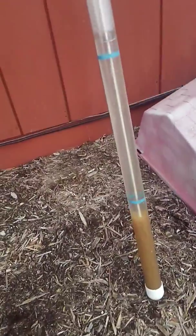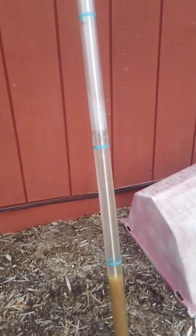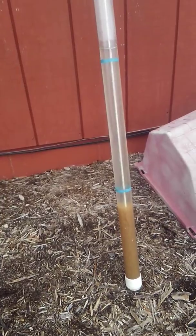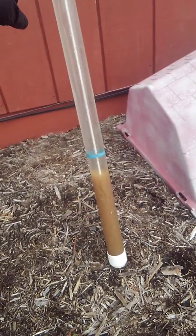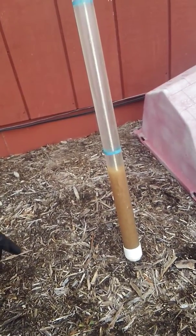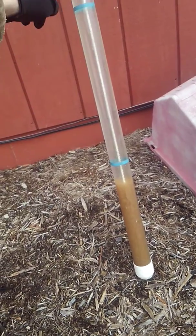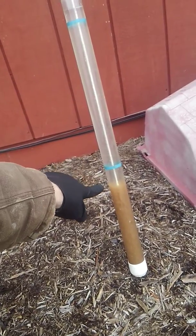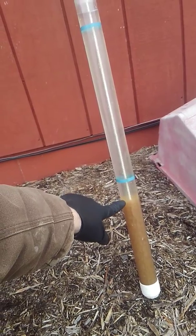I decided to shoot a quick video. I'm doing an actual septic inspection for a real estate transaction. This is my gauge that I use to judge if it needs pumped or not — these are in one-foot increments. I've got just a little over two feet here. When I first grab this, it's going to be a tan color all the way up, and then we let it sit for a half hour and whatever settles out determines how many solids are in it. This one's about 10 inches right now.